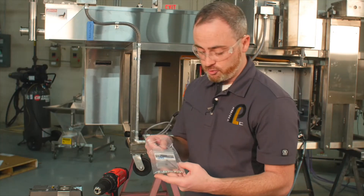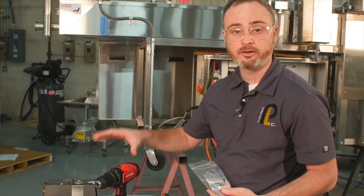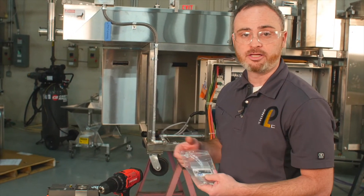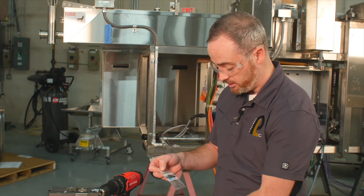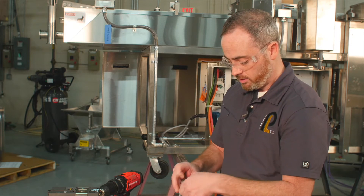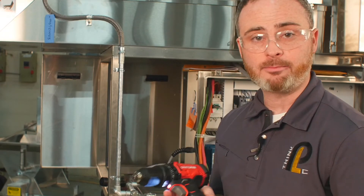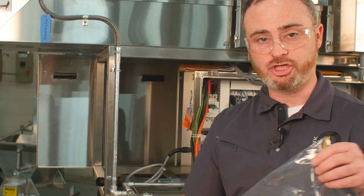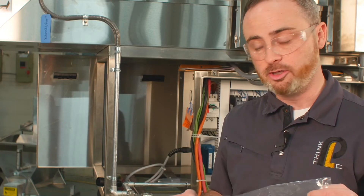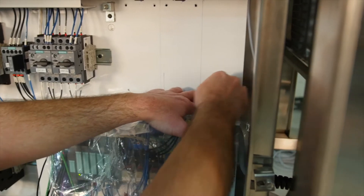Using the provided bag of screws and drill-and-tap set, prepare to create the reinstallation with a different bolt pattern for the new G120 drive. You'll find a drill bit with the proper 10-32 tap. Because we're going to make metal shavings in this enclosure, I strongly suggest repurposing the bag your product came in to catch any chips. Tape the bag over the work area so chips fall away from electrical parts and don't cause damage.